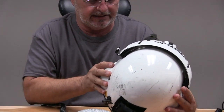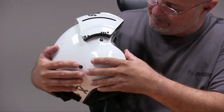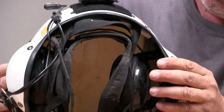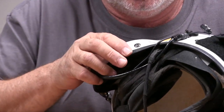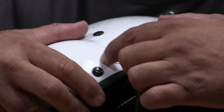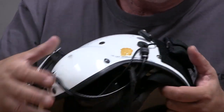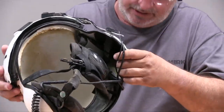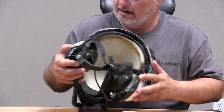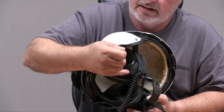Let's check for cracks. This helmet has the start of a crack right here, but it's not enough for it to be replaced because it's less than a quarter inch — we can live with that. Let's look at the back of the helmet. No crack there. Here, we have a big crack — this one is exceeding an inch. So this helmet here is condemned. We need to replace the shell because this crack will just keep growing. Continuing on with the inspection — you'll notice the edge beading is all cut up here, and the other side is loose.